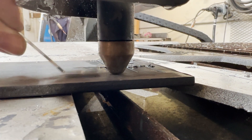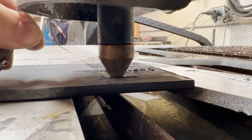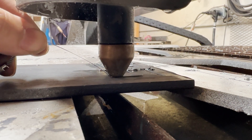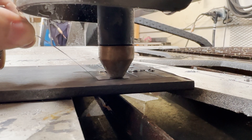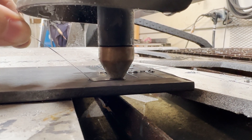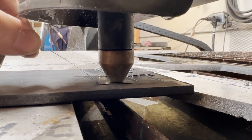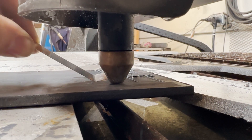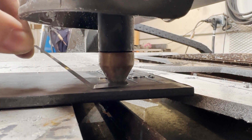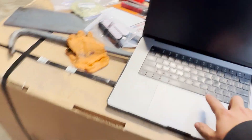I think we have success. This is as close as we're going to get right here. This is about 0.06 inches and it barely fits. I know it's supposed to be 0.06 based on the data sheet or the manual, but because of this machine's limitations it can only travel in 1/16 increments, so that would make it 0.0625. At that height it's going to be too close, so I think this height is probably best.